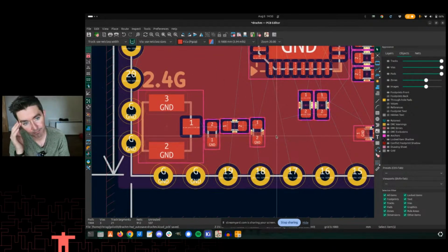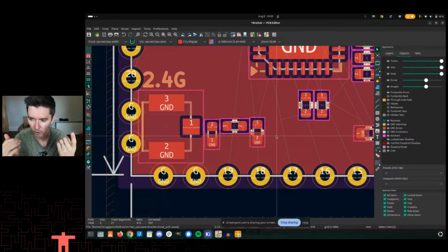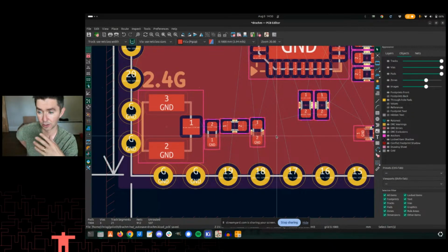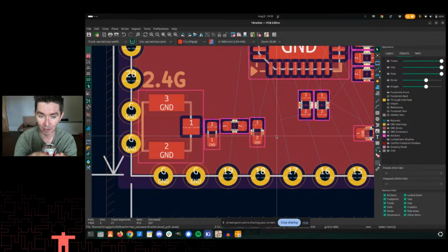As you go towards production, if you took something like this to production, you want to confer with an RF expert. You'd want to have an EMC expert as well, so you make sure you're not spewing signal in the wrong realm. And then changing your manufacturing process to match this, and doing testing as well, right? You can use something like a time domain reflectometer, which is basically send a signal down the line, you see how long it takes to come back. That's basically testing the characteristic impedance of a signal. Those are expensive, but ultimately it'll test. That's what board houses do, to test just how good their tolerances are and that sort of thing.